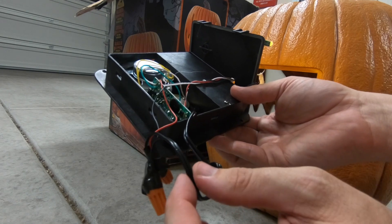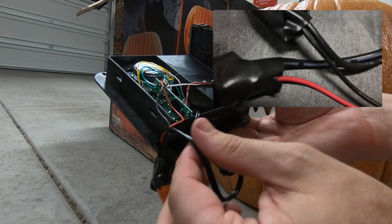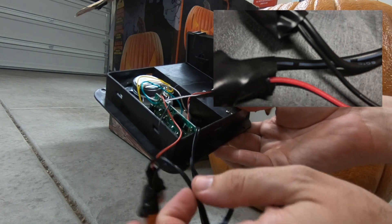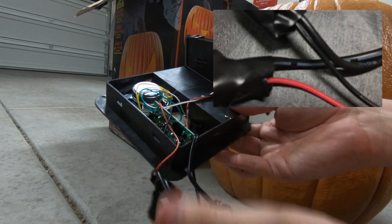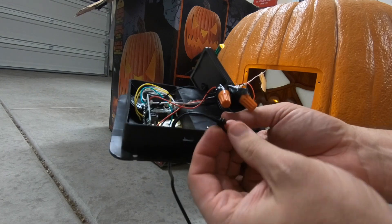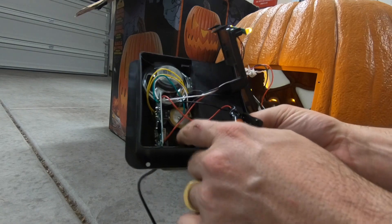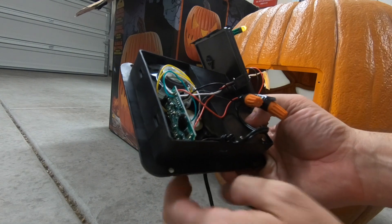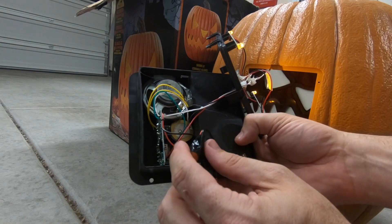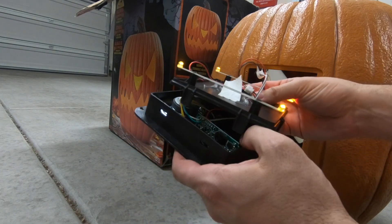Typically there's a little white line — there are two black lines here, and one will be marked with a faint white line. I connect that to the red line, and the solid black line goes to the solid black. So that's easy to remember: solid black to solid black, little white line to the red. And what's probably the most important part here is to tie a knot in the cord right here, where the knot is bigger than the hole you drilled. So if someone kicks the line, the knot stops it from pulling completely out and stripping the cable right out of the wire nuts. That's the easy non-solder way to do this.